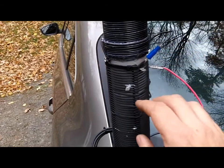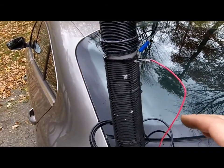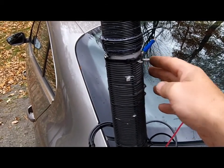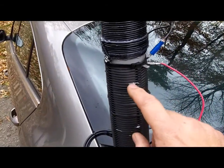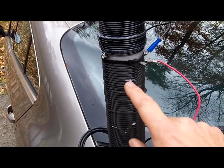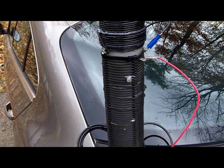This is set up for 80 meters right now — this is the top end of 80 meters right here. It's very touchy once you get into the longer wavelengths, I found. This gives me excellent SWR from about 3.890 MHz and up.